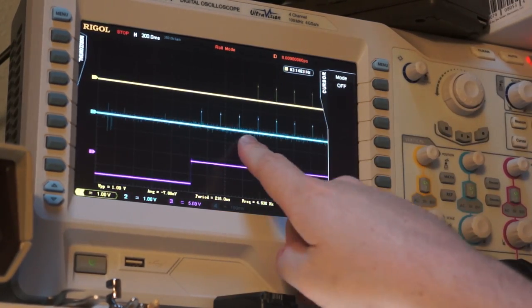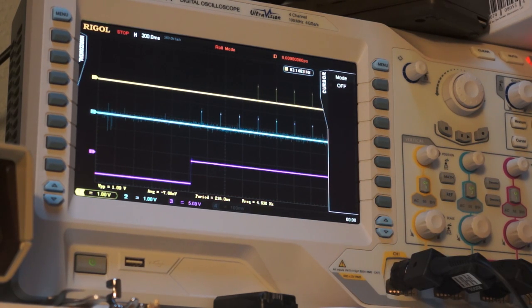I needed to switch through three ranges to get a valid signal now because I went from 60 volts to 0 volts rather than 5 volts to 0 volts. So presumably it's basically down at millivolts. With a 5 volt input, it cycles from 20 volts, 2 volts, 200 millivolts, and then at 200 millivolts it's valid, I would guess. Whereas in the other case it goes to 200 volts, I think. So there's one more step along the way. But that's just a cool little demo, and you can start to see how the various bits work.